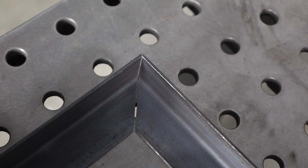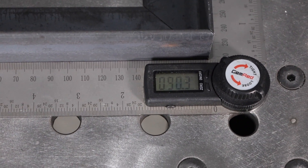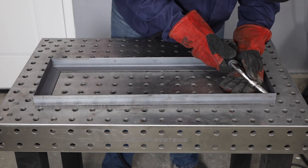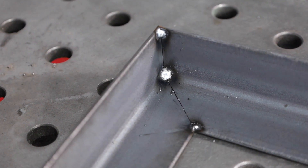The first thing I need to do is cut a rectangle out that's the dimensions of my planter box. I'm gonna do this with mitered corners — I'll lay them out here on my bench and these cuts just fit together really nice. I'll tack weld it together on the inside, putting three tacks at each corner, which will hold things nice and secure.